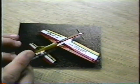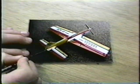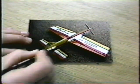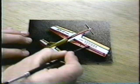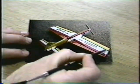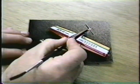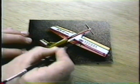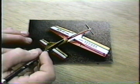I'd also be inclined, let's go back to Bill's airplane, being we're going to beat up on Bill today. When I sprayed my clear, I would spray all the edges extra, all around the trim. Wherever the trim changed color, I would spray extra. The nose extra, because this is the part they're really going to see. The top of the wing they're going to see, the top of the tail. They're really not going to see the bottom.